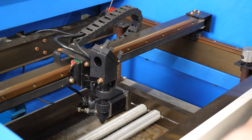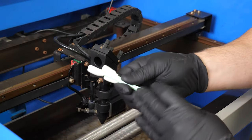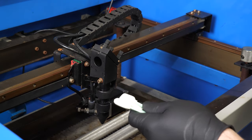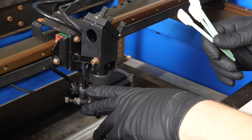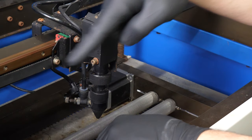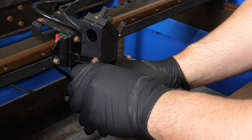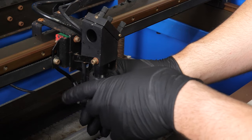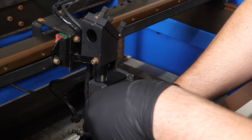I'm going to go ahead and glove up and show you how it's done. So first things first, we got some gloves. We got some basically cotton swabs — they're non-abrasive. And then you're going to need a paper towel. So we're going to start deconstructing this unit here. What you see here is basically the nozzle — this is where the beam shoots out of, passes through a set of mirrors, shoots through here and then down into the lens. So there's a nut on here and this nut is going to basically slide off.